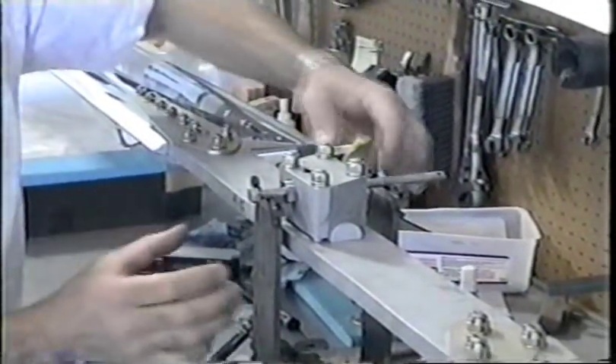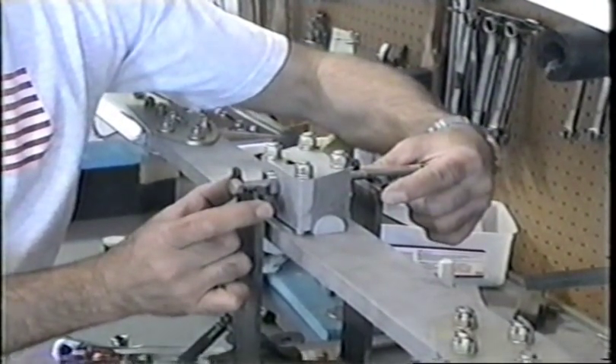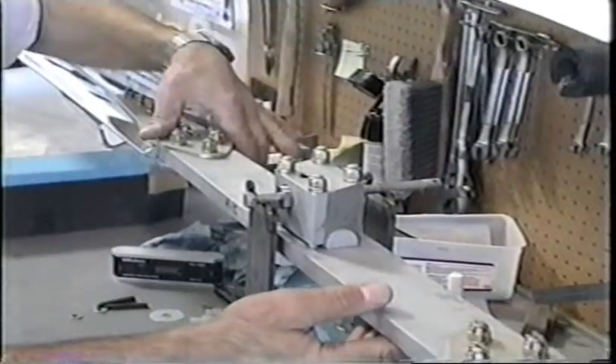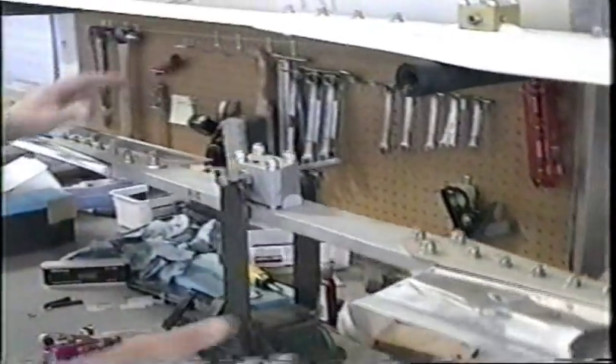To check balance on your rotor blades, you would put it between two machined or tool steel risers like this. The blade is just floating free right here, and this bolt goes through and it's suspended right here — this allows the blade just to float free.